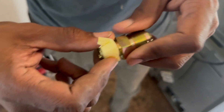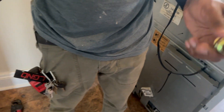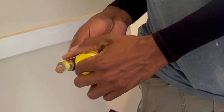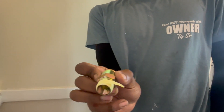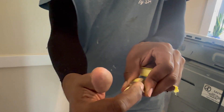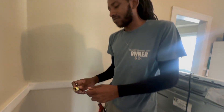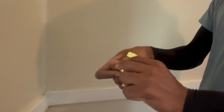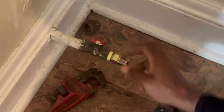The tape around there — when I went to screw it on it started unraveling the tape. That's why you gotta make sure you put the tape on correctly. If you're looking at it, make sure it's going to the right. If you're looking at the back of it, make sure it's going to the left. When you twist it on, this is what it's going to do — it's going to lay that flap down. Because if you put it on the wrong way it's backwards.